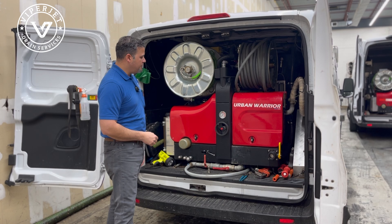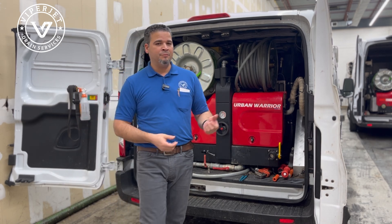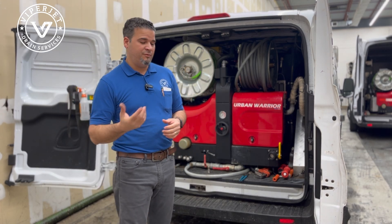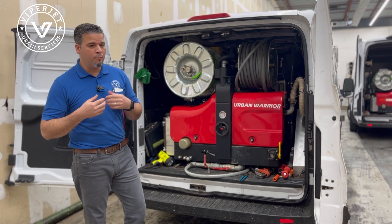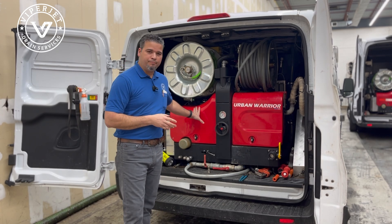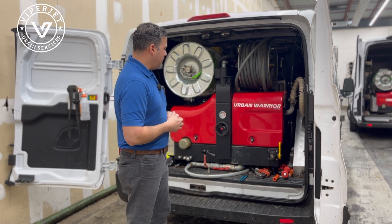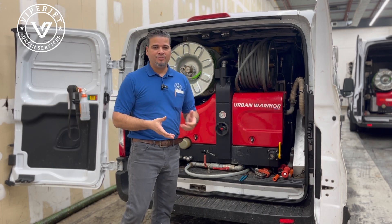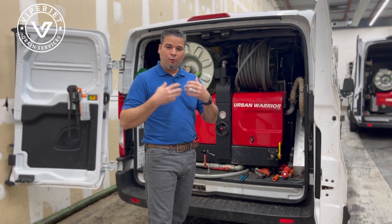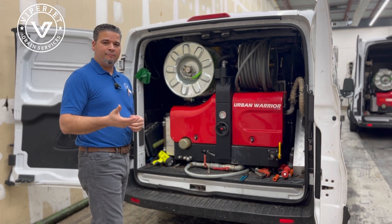Now, if you're somebody like us that does commercial and residential, and you occasionally come to a 6-inch pipe or maybe a 5½-inch clay, a long distance, full of grease and things like that — where you need more water, more volume to move stuff out of the line — you're probably going to need something like a 20-gallons-a-minute machine, maybe higher, to be able to do the job right. Because my motto is: pressure clears the pipe, volume cleans the pipe. The more water out of more jets you have at the end of your hose will help you clean pipes faster and better.